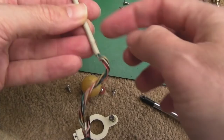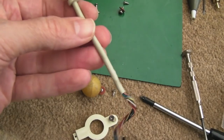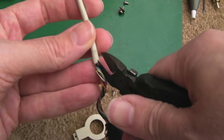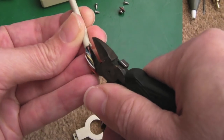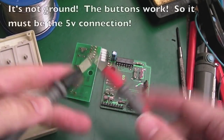Unless we trim it and then join it up here somehow - it's just going to be fiddly, nine different bits of wire with nine different bits of tape or insulation around them. So I think we'll just try this way. Based on behaviour, I'm suspecting the ground - missing ground. Because this has got a 74HC something or other on there, CMOS-compatible 74 series chip. We know that the ground is the bottom right pin there.